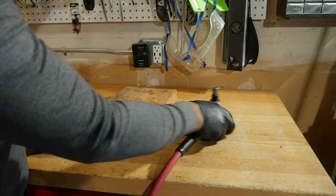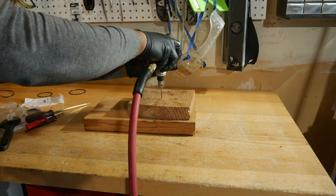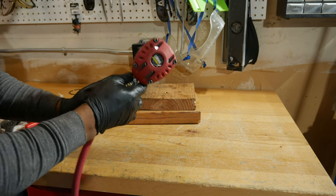Alright, so I've got a couple blocks of wood. We're going to try to nail this and see what happens. Wow — so surprisingly, this is actually working again. Looks like we solved our problem. So there you have it — repairing the Harbor Freight palm nailer. As you saw, the main culprit was that M46 by 2 O-ring. That one actually comes in a kit of 10, so if you buy those on Amazon you can just keep changing them out if you have issues in the future. I don't know exactly why the original failed so quickly, but I think we'll get some life out of this new one. Hopefully this information was helpful — thanks for watching.